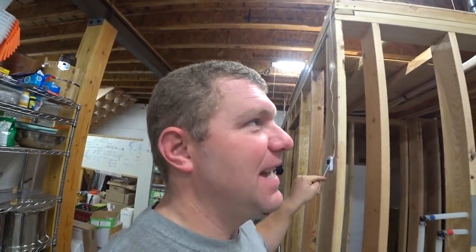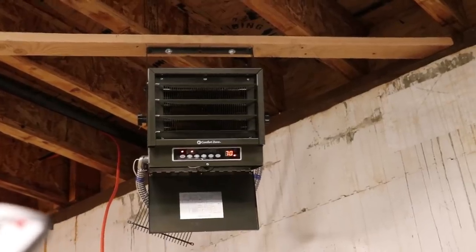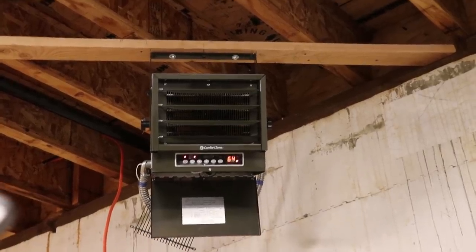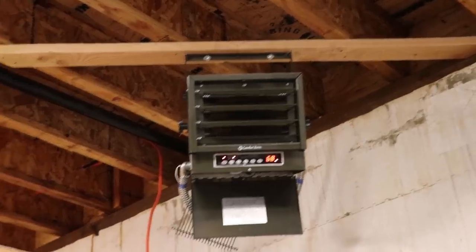That tells me that this is a thermocouple, and that's the one that it's reading now. I'm kind of coming to the conclusion that we're getting it right, because the heater's still on. It's been on for 3-4 minutes now. I guess what we should do is turn the thermostat down to the room temperature and just make sure that it turns off, right? That makes a lot of sense. Let's go to like 64. Cool, so that shut it off immediately. That's encouraging. And let's let it go through the cool down cycle and then we'll try turning this back up and see what happens.